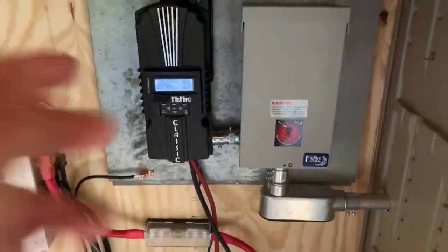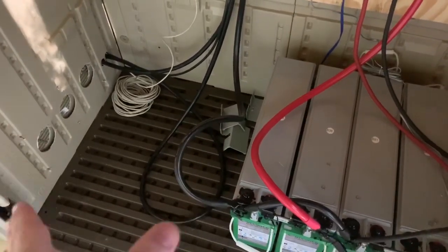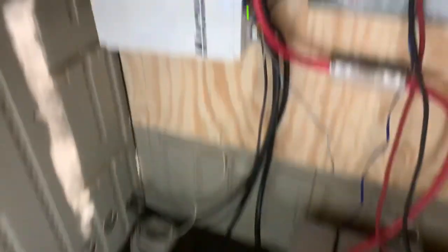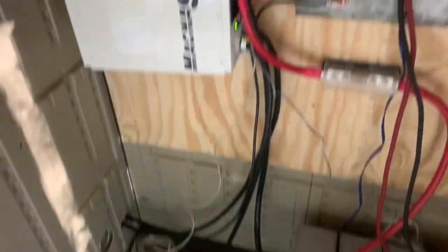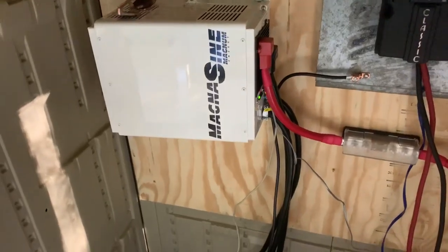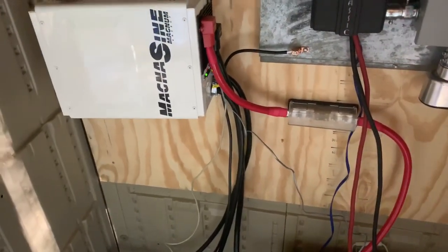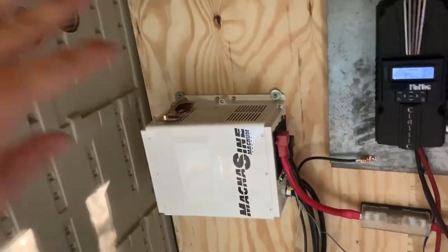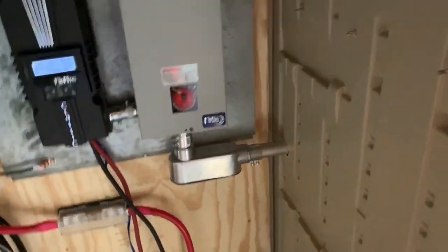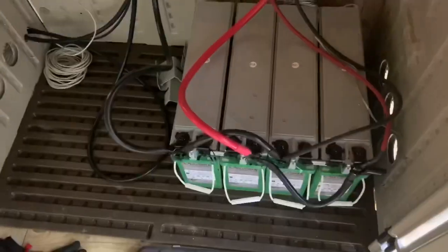From the OTG board we're dropping down to the battery bank. The customer can add an additional full bank beside this one later — there are two banks in there right now. This is a 24-volt setup and everything is common bonded for grounding, going down and out to a ground rod. This is one Magnum 4024PAE unit. You can always stack these — the customer can stack an additional unit and have 60-amp service; right now the service is 30-amp. We put louver vents in so air can circulate, and in wintertime you can cover those with insulated foam.